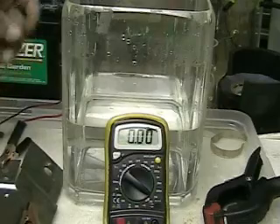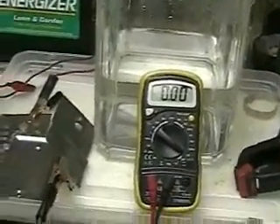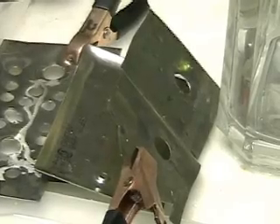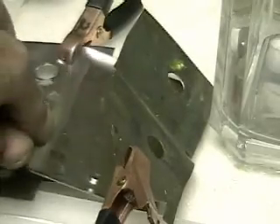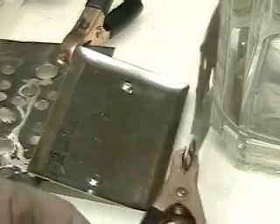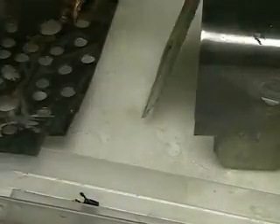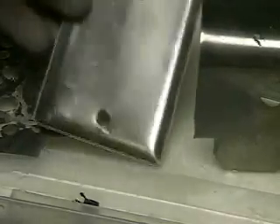They're very close to the same size. If these plates give us the same reading, then we'll pretty well have confirmed that the thickness of the plates does not make any difference. As you can see, that's the stainless steel plate alongside the thinner plates. The plate we're going to use in this test is the one on the far left — the one with holes in it. These are all stainless steel and we're using a 12-volt battery. If this shows the same amount of current going through, we can pretty well believe that the thickness does not matter.